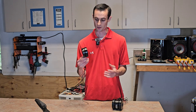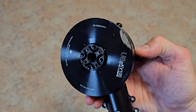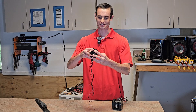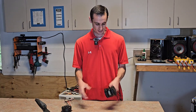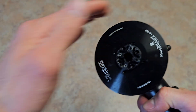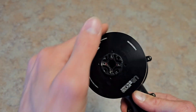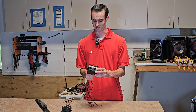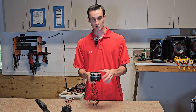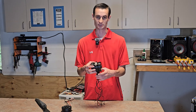What I've been doing is I remove the side that is broken or fractured, and I throw on another half from a different propeller that's in good shape. Here I have a couple of motors as an example. This one came off of a coaxial configuration — it has dings all over the bell housing, the mounting bracket is totally destroyed, and the motor is completely seized up. Here is another coaxial example: this motor is great, but the other side I almost can't spin at all. It feels like it has gum in it. So I cut it in half and slap another good one on the other side, giving me a coaxial setup with two good motors.